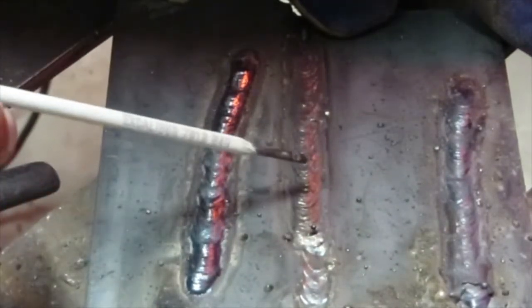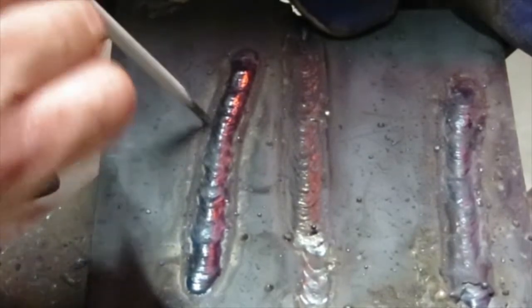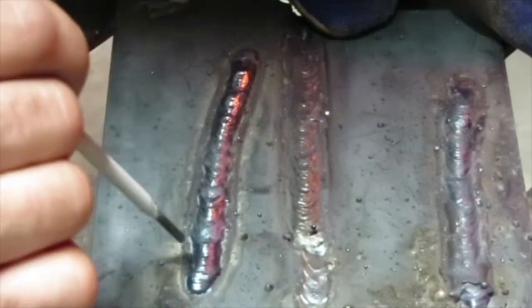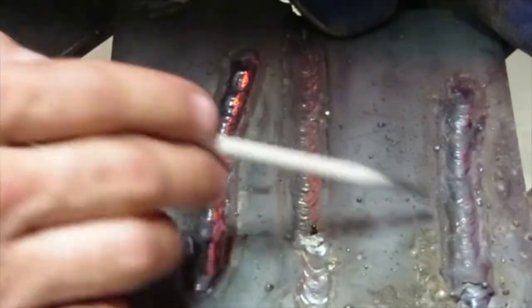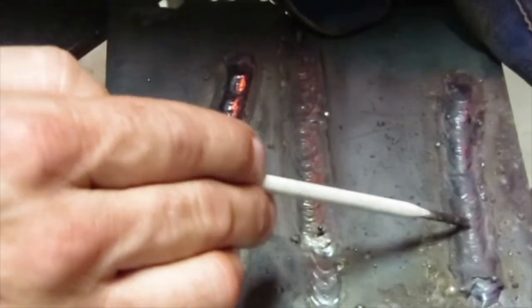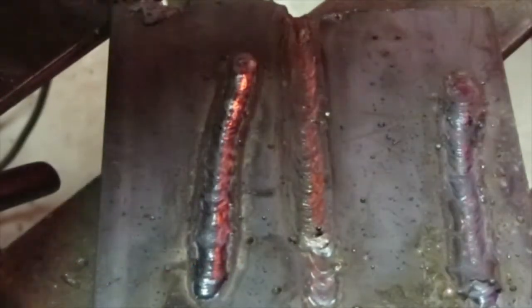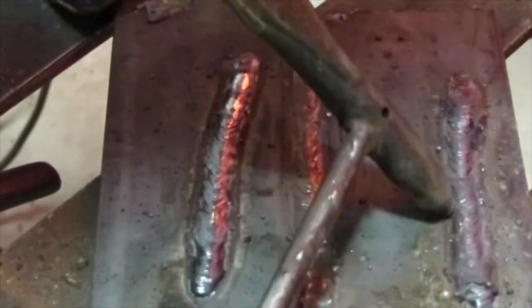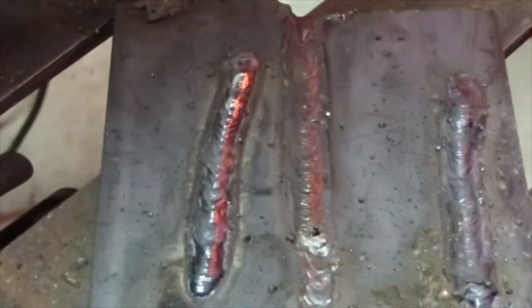My temperatures were too hot — they need to be turned down. But I don't have any undercut in here because I made sure to push that rod in and not have any undercut there. My speed was a little fast right in here. With undercut, when you get that weld done you need to make sure you chip all that slag off so you can go back and weld.